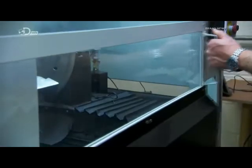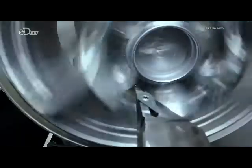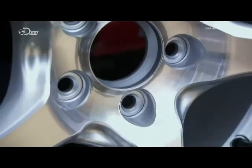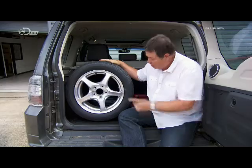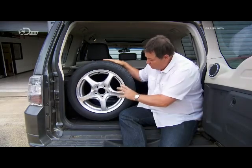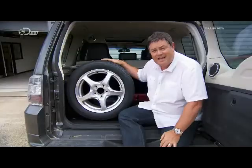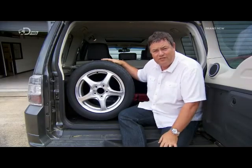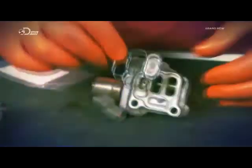It takes just a few short minutes for the blade to strip the top coat, giving that highly polished front surface that looks so good. After a layer of lacquer, the Honda wheels are restored to an as-new finish. Isn't that just fantastic? I could have changed the color, but I'm glad I didn't — I kept the wheels as they should be, original. That diamond cutting process has really finished them off. It's also nice to lend a hand — gives Ed one less thing to worry about. Now I've got one loaded up, let's go and get the other three and get back to the workshop.